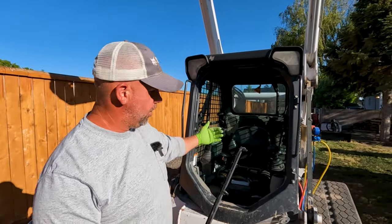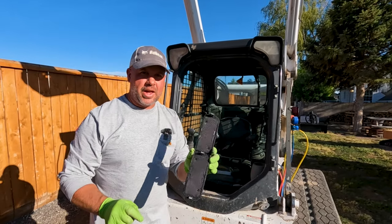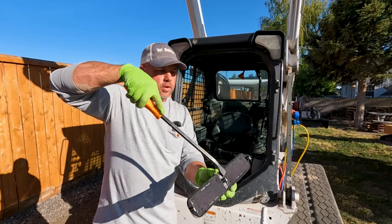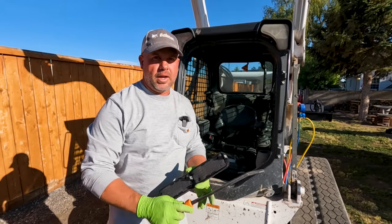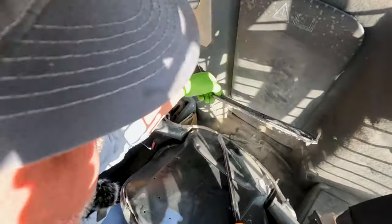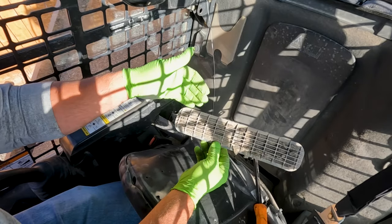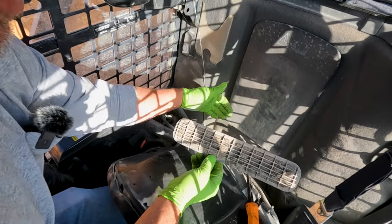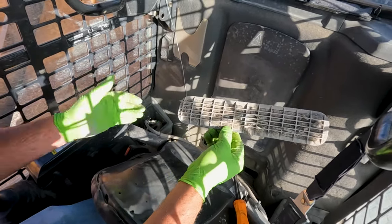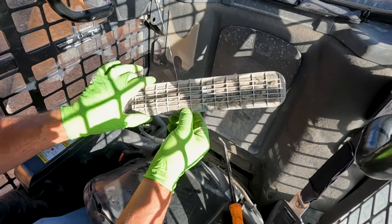Now this is my recirculation filter that is behind the seat. I've got the seat slid all the way forward so I can reach over the back to put this in. You can see it's got these three metal clips on here, and this thing is a real pain to pop out. So I just use a pry bar — put it back here in each corner, on either side in the middle, and we just pop that filter right out. That filter is absolutely disgusting. A lot of people don't even know this filter is back here. A lot of times what I see is clipboards, paperwork, bottles, trash — everything blocking the flow of this recirculation filter. So it's important to keep behind the seat clean if you're having AC issues, and always make sure this filter is clean and free of obstructions.